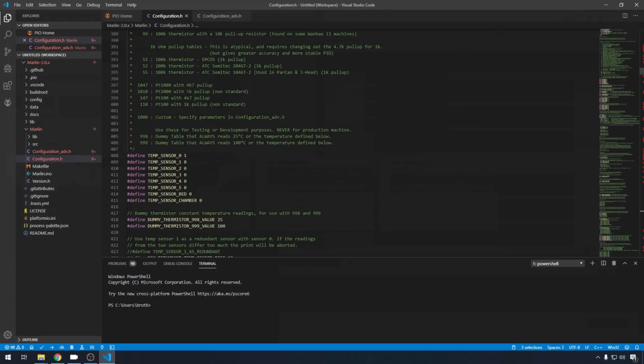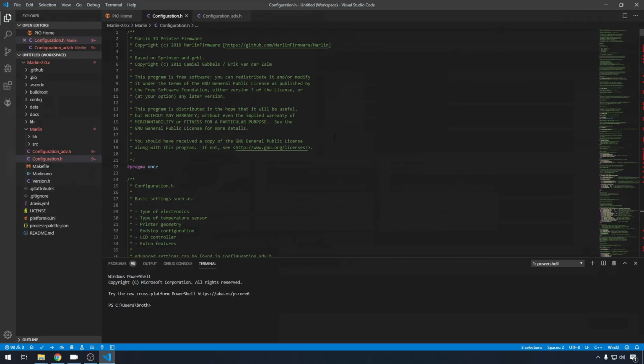And we'll start in configuration.h. In this video, we're just going to focus on the things you need to do to get auto bed leveling set up. Everything else for this configuration has already been set up to work with my printer. I have previously done step-by-step configurations of Marlin for 3D printers. If that's something we want to walk through in Marlin 2.0, leave a comment below.